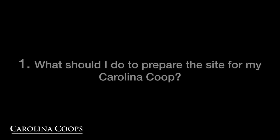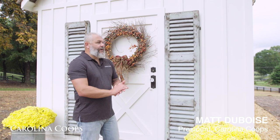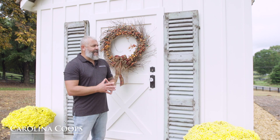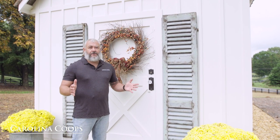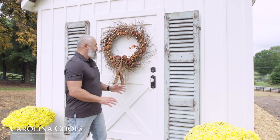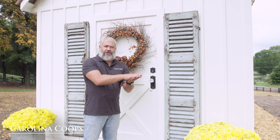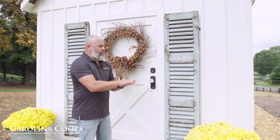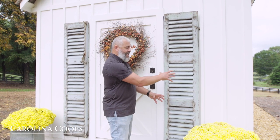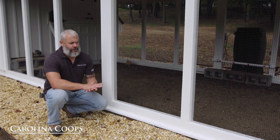What do I do before you show up? It all starts with picking a spot — in this case out here in the front lawn. The space absolutely has to be level. If it's not, especially a coop this big, it's going to look awful, the doors need to function, and every structure is eventually going to settle. The best way to prevent settling is to make sure the footer — in this case a concrete slab underneath the henhouse shed area — is solid. You always want a flat, level surface for the coop to sit on.